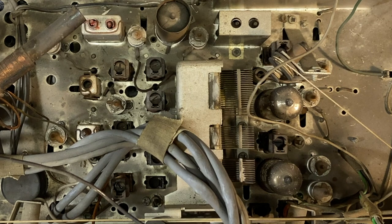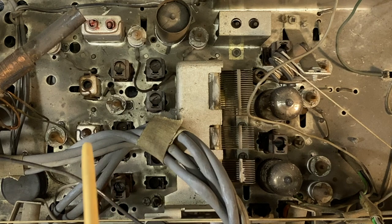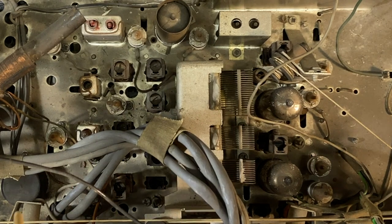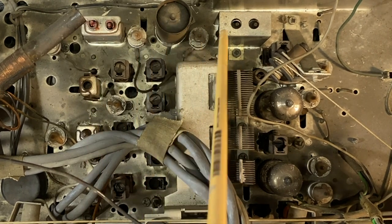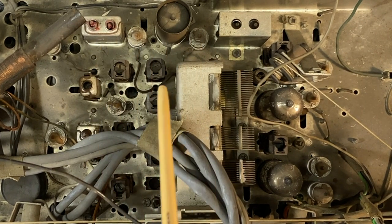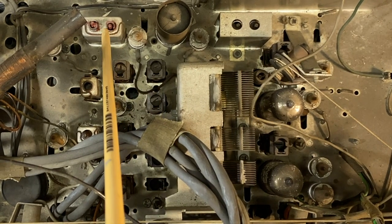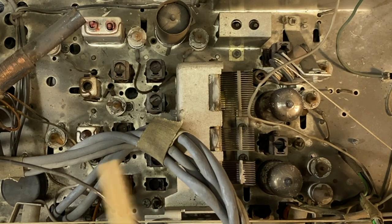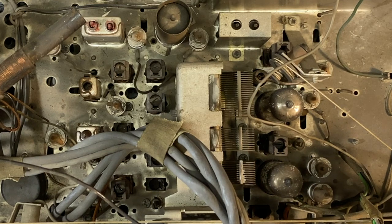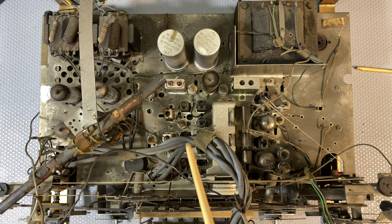And then here we have all the inductors and capacitors for trimming and so on, and the IF transformers and everything else. Again, they look different. Oh, here's one, here's the other. Those IF transformers look completely different to what we used to. This one is double shielded. This is just a little screw on there, so that should be quite easy to tune. But what you can see here is everything is sort of gray-black. This looks like it's come from a coal mining town. It's just gray-black everywhere. The grime on this thing is amazing, which means that the cleanup will be amazing.